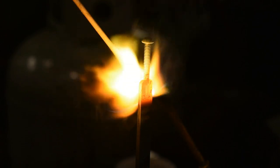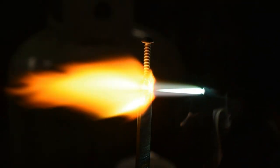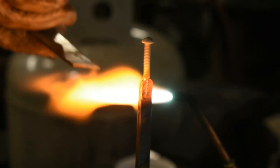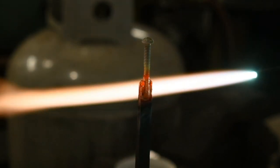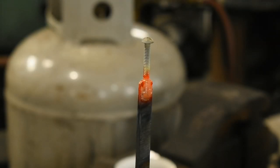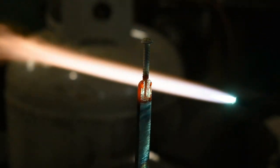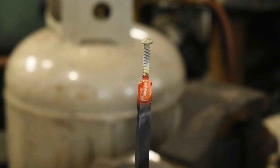Melt the brass a little, blow it. Same from the other side. Make sure that brass wets out. Sucks into the joint from both sides. Keep it a little hot, scrape off some flux. And we're good to go. There's number two brazed. A lower orange color visible. Reduce that grain size, stress relief. We're gonna let that air cool. Doing that on both of them twice.